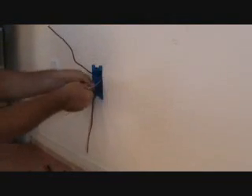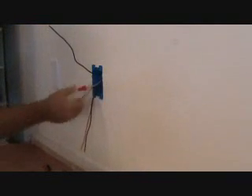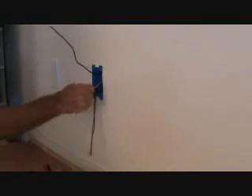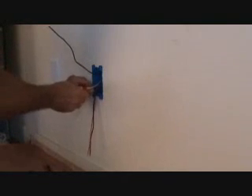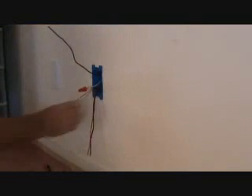Now you want to check the wires and make sure that they feel tight. Sometimes you can get it to that point and think the wire nut is tight and you can't twist it any further — and then you check a wire and one of them pops right out of the back side. That sometimes happens, so you always have to check that.